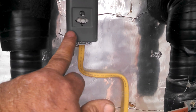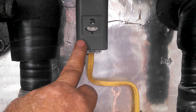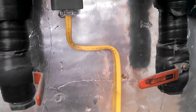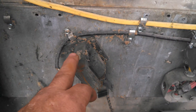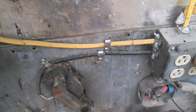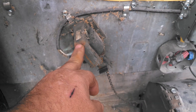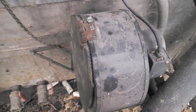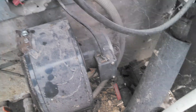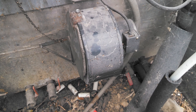This is the only means of heat I have. This is a thermostat — this is what regulates how hot this stove gets. I keep it set on 150 degrees. A lot of people run them at 180; I can't justify it because it just wastes wood. This solenoid right here — when the thermostat calls for heat, it tells this when to come on. When it comes on, it opens the door and starts this blower up, and the blower is what stokes the fire.